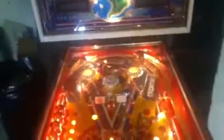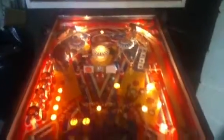And I was going to put LED bulbs in this, but I put some in, and the problem is they flickered because the light driver board does not like the LEDs. I've heard of putting resistors on them. Supposed to take care of that. I don't know. But I'm going to research. If anyone out there knows what transistor to replace with.